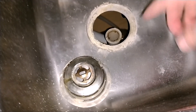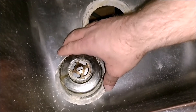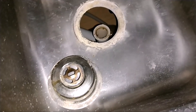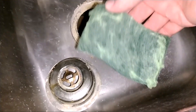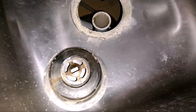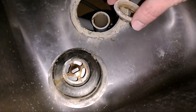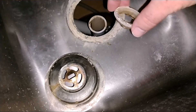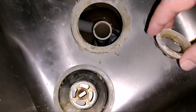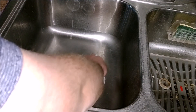When you clean up all the sealing surfaces, get all that plumber's putty off the sink side. I'm going to reuse this, so I need to clean off all that — I'll use a scrub sponge. There is a gasket here that you can replace; I didn't grab one, so I'm going to clean it off and reuse it. Let's see what we can get off with just a paper towel.